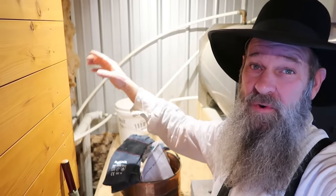One of the questions we get a lot is what do we do with our gray water. Gray water is the water that falls to the drain and goes out of your house. Since we live off-grid with no public utilities, there's no sewer lines and we don't have a septic tank. We poop in five gallon buckets and make a composting system out of it. For gray water, I trenched in lines out to the forest — all this water with biodegradable soap goes right out to our tree line and waters all of our trees.